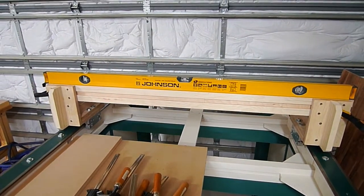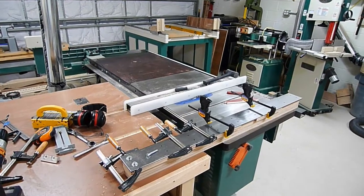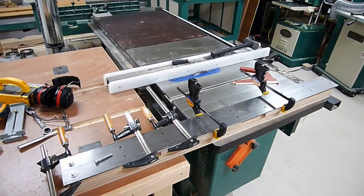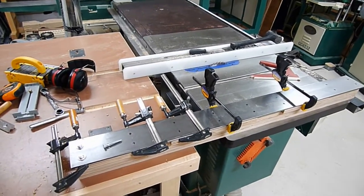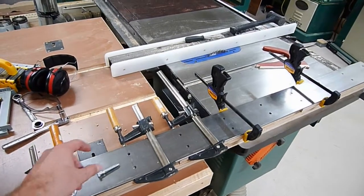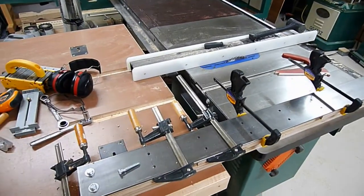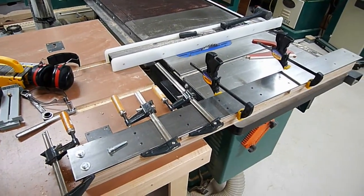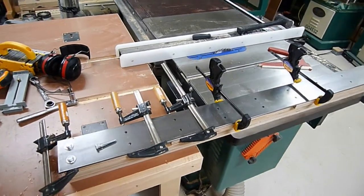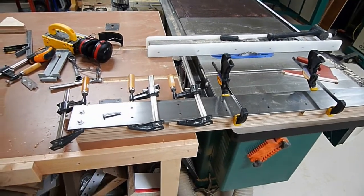I got that piece of steel drilled now. This is a piece of steel that runs the entire span of the gantry, and I went ahead and did two holes at nine different locations all the way down — so 18 bolts total. That's going to hold it nice and tight so there's not going to be any flex.